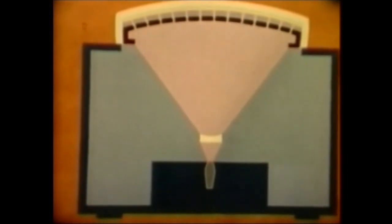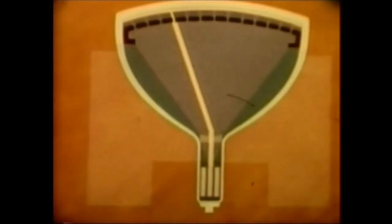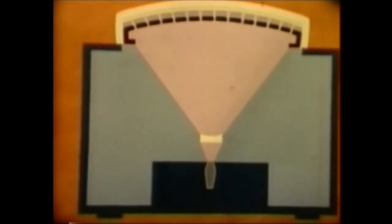The position of the light source is critical. The light must strike the phosphor at exactly the same points as will the corresponding electron beam. The action of the light hardens the phosphor so that the exposed dots adhere firmly to the faceplate. After the mask has been removed from the faceplate, the unexposed phosphor is washed off. The faceplate now carries a regular pattern of green phosphor dots.